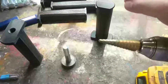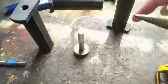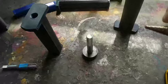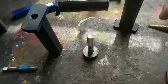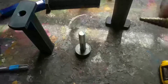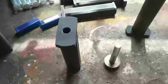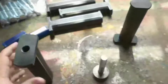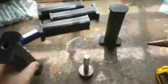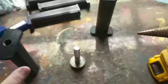You want to drill just a tiny bit bigger than your bolt hole, but not very much. These are M16 bolts because I have a rep rack from China. A 5/8-inch hole is just too small, but the next size up — a good snug fit — is 11/16ths, so that's what I'm going to be doing. If you don't have to drill holes for your power rack, you're awesome. I have a cheaper rack and I don't mind putting the work in, so that's what we're going to do next.